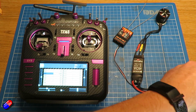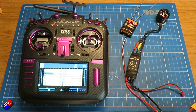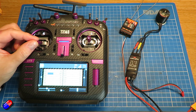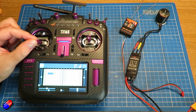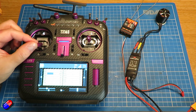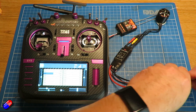So the radio is plugged in — we're going to just show that the throttle is not calibrated. I'm going to wait for it to power up and go through its initialization beeps. Once it's finished, I'll move the throttle. And because it is only coming on at about 1200, you'll see that I can move my throttle quite a way before the motor starts running. There's a lot of dead zone here at the bottom, and that's not ideal — that's absolutely what we need to get rid of. By doing the calibration, we'll do that and teach it what high and low throttle looks like.